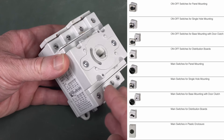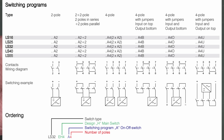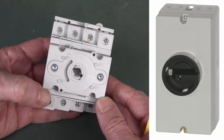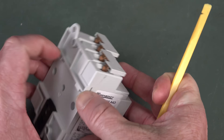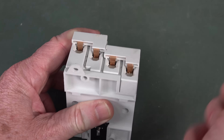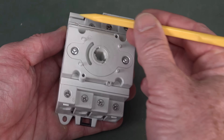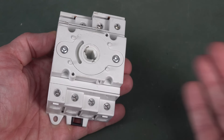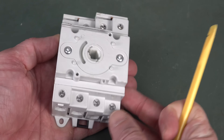This is just the switch unit itself, but it does come in different enclosure and knob variants, different wiring arrangements, and all sorts of stuff. The datasheet link below is very comprehensive in terms of how you can configure this. Mine was in a waterproof, weatherproof NEMA case designed for outdoor use. We've got four screw terminals in and four out, but this one actually contains little shorting links — they're putting two of them in series. So it's basically a two-pole single throw switch. The reason you put them in series is you double your working voltage, because you're putting two switches in series. You're not increasing your current capability — that remains the same. But now you've got two switches in series that are breaking, so you've got higher voltage arcing capability.